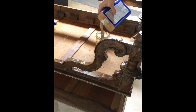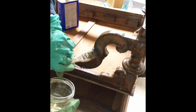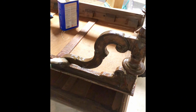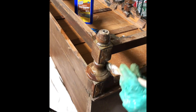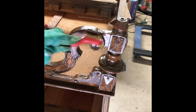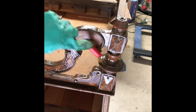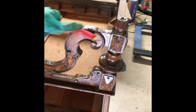One of the main reasons I got this piece was this really cool base. So I decided I wanted to strip it down. I applied the stripper and did a lot to it — you can see all those little intricate pieces. That got some of it off, and then I had to sand it. There are so many little intricate parts that I ended up getting out my Dremel and very carefully used it to sand. You have to be real careful because Dremels can be very aggressive, but it was able to get into some of those areas. It was really difficult. And then I ended up bleaching it as well.